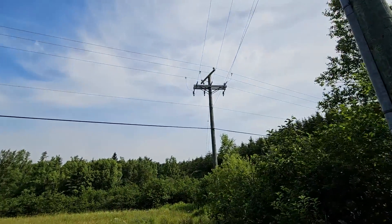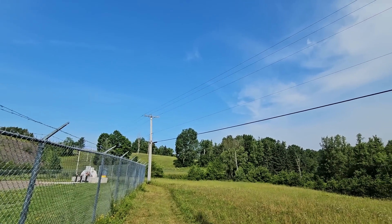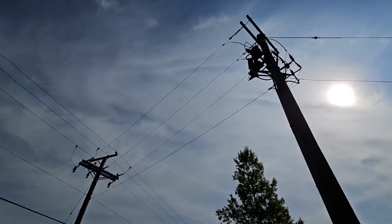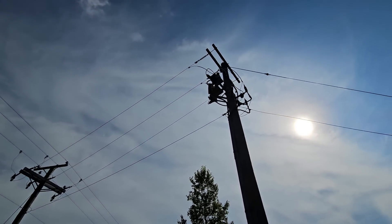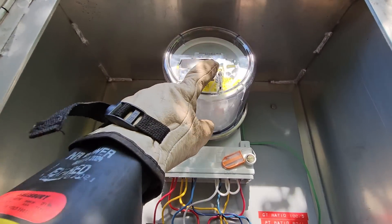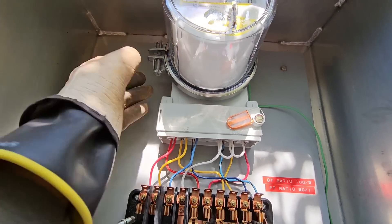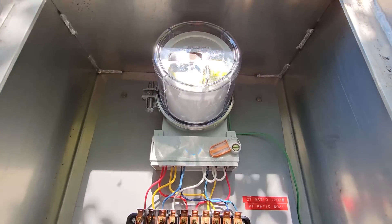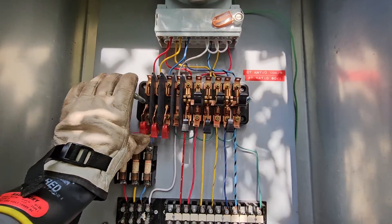Just to show the setup a bit better: that three-phase line is the main feed coming about 50 miles from the country, and this is just a side tap. If we wanted to isolate this metering unit we'd pull those cutouts and open those switches — that shuts power off to the customer and isolates the metering unit. The new meter is now installed. Before re-energizing, make sure the meter ring is on — it grabs the meter and secures it to the socket. If there's a short, at least the meter won't blow off; it's unlikely but it's an extra safety step.